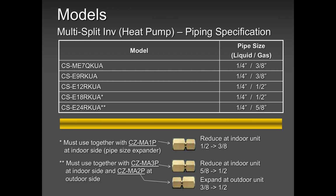We have been very successful with 3/8 and quarter inch for compressor durability. And it has proved for more than 10 years. We have no issues, perfect oil return. And guess what? You're not spending much money on piping. Only 3/8 and quarter, guys. So you're win-win. You're winning all the time. You don't want to run 5/8 and 1/2 inch.